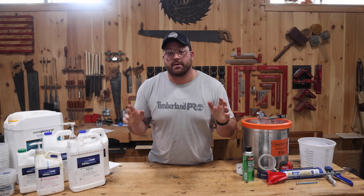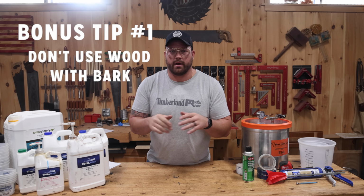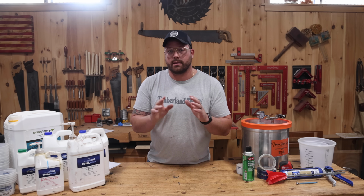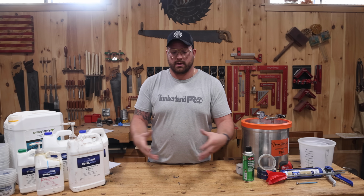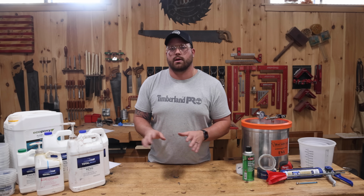And because I'm feeling generous, here's a few bonus tips for you. One, don't use wood with bark on it, ever, period. Get the bark off of it. The bark will fall off. And even if you think it looks cool and looks good, I am sorry, but it's not going to work. And you're never going to get a river table with bark on it, because then the epoxy bonds to the bark, and then that pulls off and everything moves and it cracks, and it's not good. Get rid of the bark.